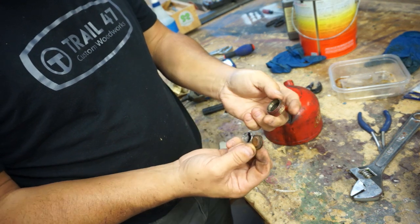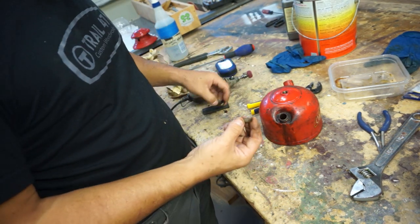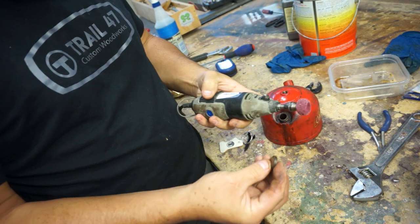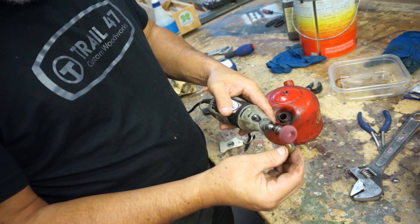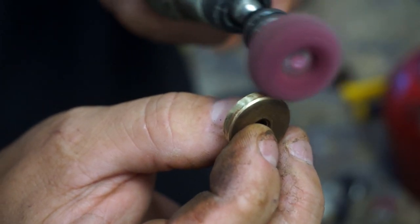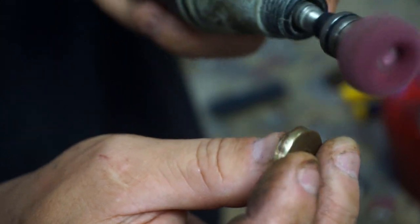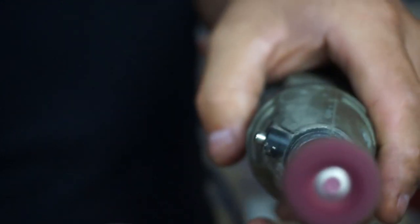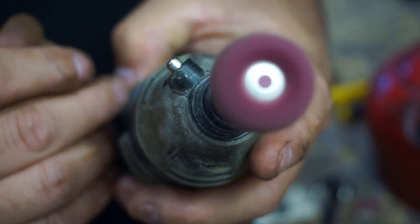So inside the gas cap is this brass seal. I guess this is what snugs it on so gas doesn't leak out. I did want to show you how I've been cleaning the parts with the brass parts. I've got these sanding balls that go on your rotary sander, and they work really well, and they clean up the brass really nice. And because they're kind of a soft ball, they can get into the crevices really well too. But you see how well that brass is coming up? It doesn't take off very much, just takes off the grime and shines it up and makes it look pretty. And this you're not even going to see, but I still wanted to clean it up a little bit. If you look in the description, I'll have a link to this item too if you're interested in it. They're pretty handy for getting small areas.